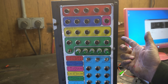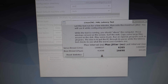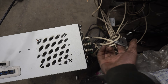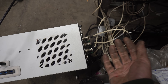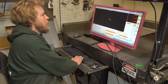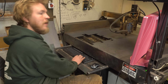I'm running a latency test and honestly it looks better than I thought it would. We've got about 16,000 nanoseconds of max jitter, which is honestly better than my other two CNC machines — so I don't even think I'm going to mess around in BIOS to fix that. I've plugged the X and Y motor aviation connectors from the plasma cutter into the new setup. Testing time. I've set up a little config here — we're moving! This obviously isn't tuned at all, but this is just me testing that the machine's working. And it is!